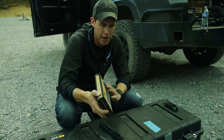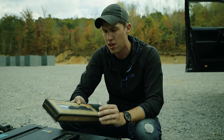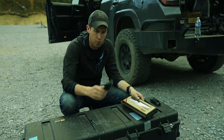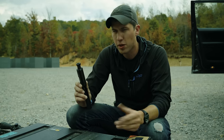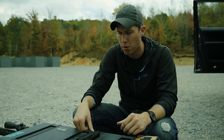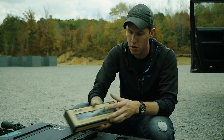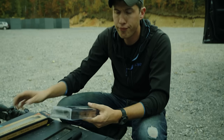So rather than throw this whole bolt into the gun, because this won't be headspaced to the barrel and it won't be very good for the test, we're going to harvest the firing pin out of this bolt and throw the rest away, just kidding, we'll put it in the armory. Then we'll use the existing bolt carrier group we've been using for the last 2,600 rounds, whatever we're at, and continue on with the test. If this firing pin breaks at another 2,000 rounds, just like the one before it, safe to say there's a pretty consistent problem, but it may not, we'll see. We're also going to start shooting suppressed pretty soon. So let's go ahead and swap this out and get back to shooting.